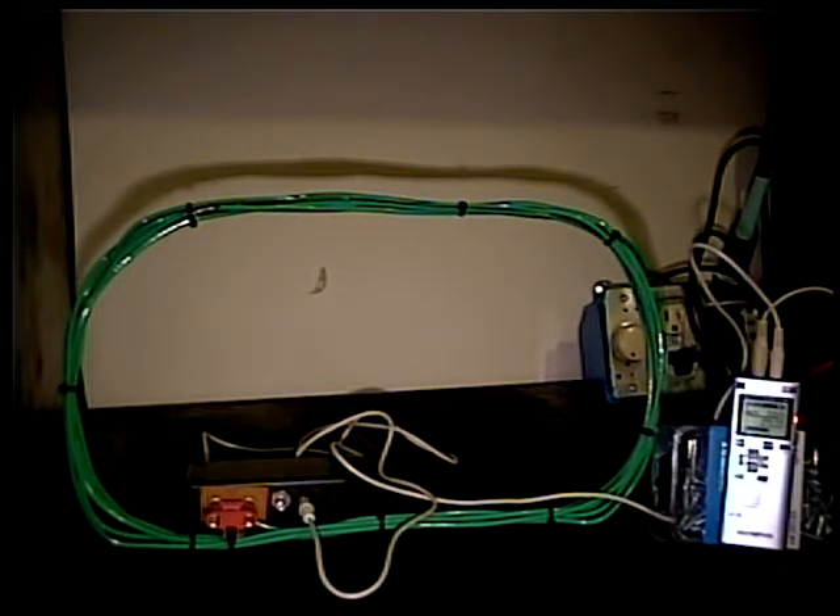I was able to easily wind 800 turns, so I ended up with 20 turns to 800 — a 1-to-40 step-up ratio. And about five or six turns of number 14 wire in this coil, which is approximately 8 by 13 or 14 inches with rounded corners, is all it takes to receive what we're hearing right now.